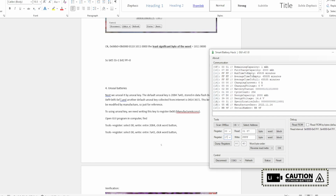Lithium-ion batteries are very dangerous. Do not play with them — do it safely. You cannot directly solder wires to the battery; I have heard it can induce a small energy into the battery and cause a chemical reaction. I have done it many times without issue, but I still warn you: do not try it, and do it at your own risk. If you are using the same cells, you can just clear the permanent flags, clear the cycle count, enter the FCC and design capacity. But if changing cells, do not use old parameters — overcharging can cause explosion or overheating.